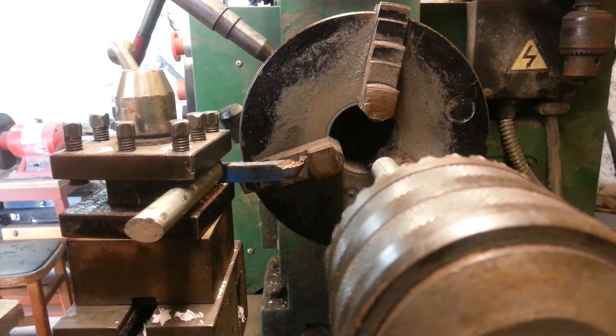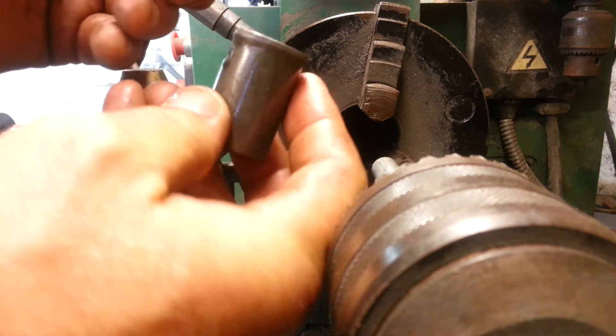On the way back in, I've cleaned up the bushes with a 4mm drill bit. You have to side-load the drill a bit because the bush is actually supposed to be 4mm, but with the build-up of this black crud on it it's a very small amount less. A 4mm drill bit actually measures about 3.93, so you have to side-load it just to scrape out the black stuff from inside the bush.